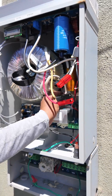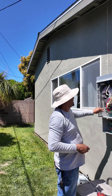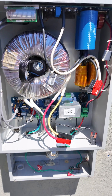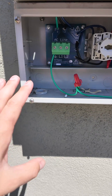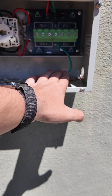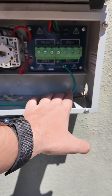So here's what we have next to us — this is a PVI inverter. This is a very old one, it's a 3800 watt. It's just amazing to see how far the technology has come in the last 10 years, and just in the last five years for the battery side of things. Let's flip you around so you can get a nice close look. What you've got going on in here is a giant transformer, basically — it's converting that DC energy into AC energy. Down here is the cable management box, where your DC disconnect is. You can see it's labeled for the PV input to come in. Not a lot of MPPTs — that's one thing these older inverters didn't have: multiple power point trackers.